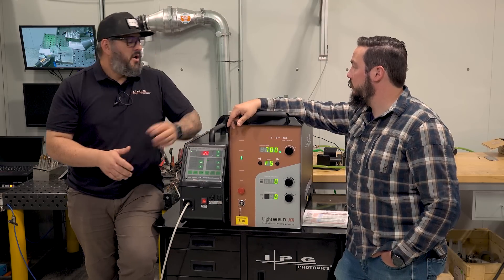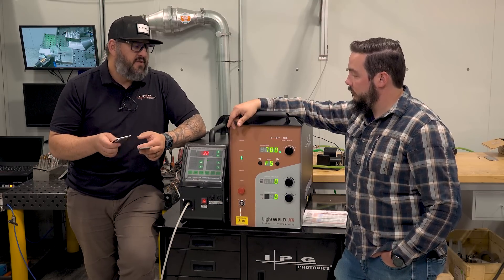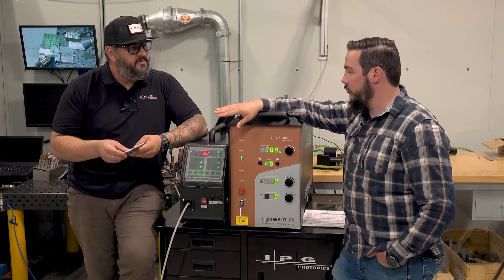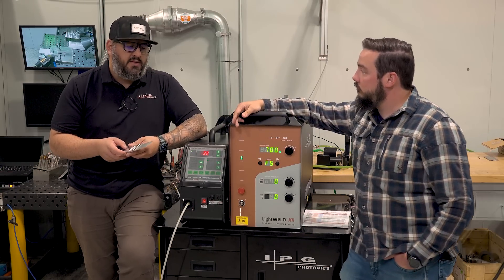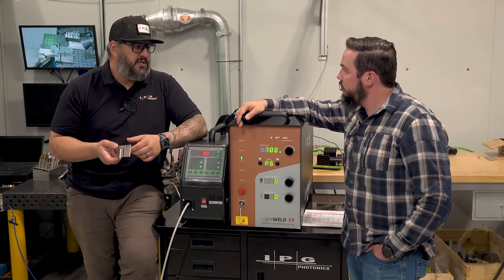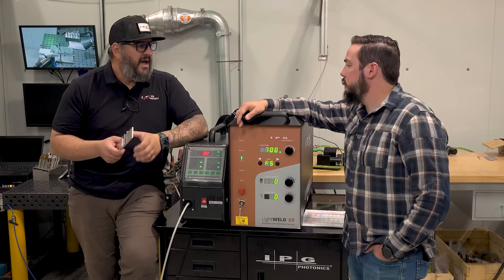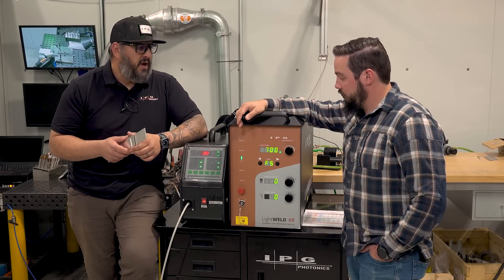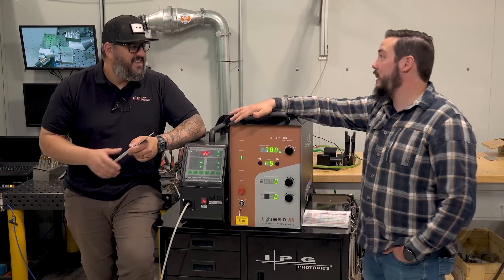What kind of materials are we welding on? We've got some coupons here — this is 6000 series aluminum, and then we have some 5000 series aluminum as well, in different thicknesses. We'll do some T-joints and some butt joints, and we'll do fusion and wire welds. The 6000 series is newly accommodated with the XR machine. With our other two models, the 1500 and the XC, you're only able to do 3000 series and 5000 series aluminum. With the XR, we were able to shrink down our spot size on the laser so that we can penetrate 6000 series a lot better. So we have that extended range of capability on the XR.